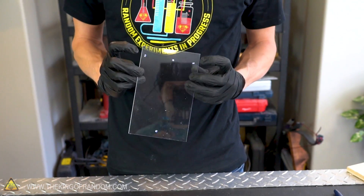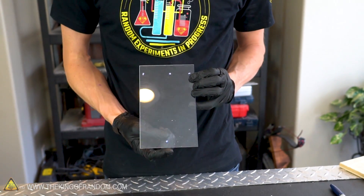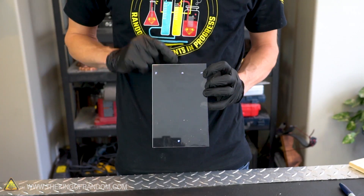The four holes you marked in your plastic will be used for different things. The two on the outside at the top and the one at the bottom will be used for the supports that hold up the entire plastic frame. This one in the middle, however, is going to be used to hold a focusing lens that lets your phone camera see much, much closer than normal.